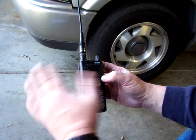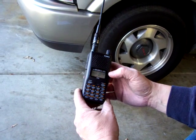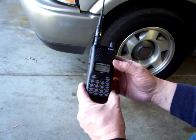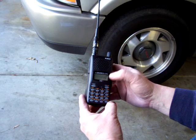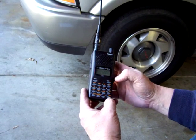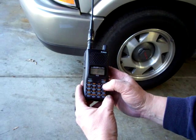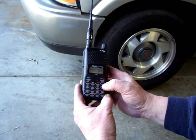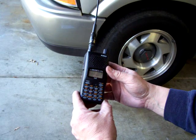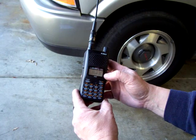When you key it up, it just stops whatever you were doing at the time. What we want to do is set for the 640 machine — 146.640. Let me start over. We don't want to have any numbers here on the bottom. So we hit the VFO mode and then go to the band we want to set. We want VHF, so I hit VFO and hit the band. Now we're in the VFO.